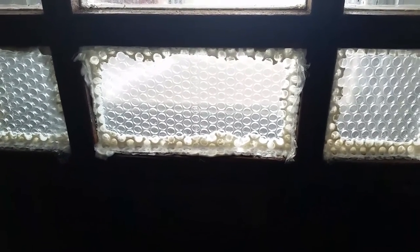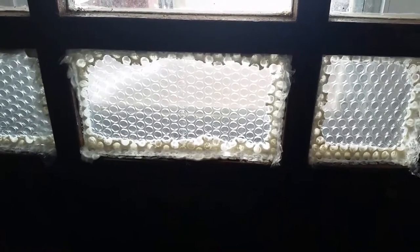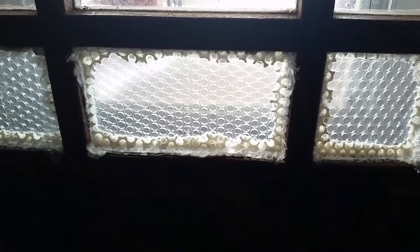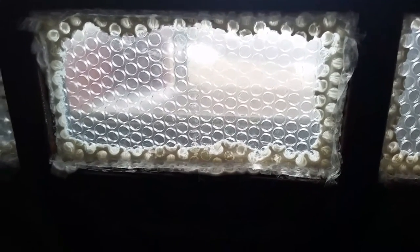Then you cut a piece of bubble wrap. You can cut it to exactly the size of the window pane you want covered, or you can do what I do and cut it larger. The reason I cut it larger: your next step is to line the windowsill on the glass pane — right where the glass meets the window frame — with caulk. I've used a white caulk that dries clear, and once it's dry it looks really good. Use a generous amount of caulk — not huge globs dripping everywhere, but a nice thick layer right where the glass meets the frame.